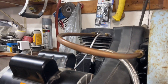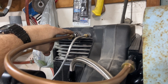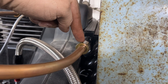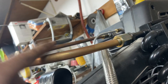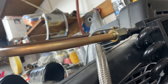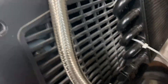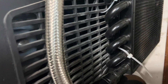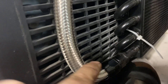I'll talk a little bit more about that in a moment. So you've got the little adapter nipple going to the compression fitting, with a half-inch tube coming around to this cooler core, then another half-inch JIC compression fitting to the dash-8 AN fittings that came with this cooler core. You've got one on the top and one on the bottom. Now this is the hot side — you definitely want that to be something that'll hold up to the temperature and the pressure. This soft copper tubing is going to be your cheapest option. On the bottom I do have a braided hose — this is a high-pressure, high-temperature fuel or oil line for race cars. I only used this because I already had it and it was a little bit easier than making multiple bends in that copper tubing.